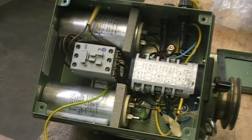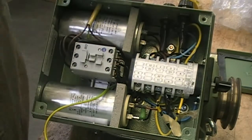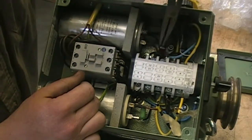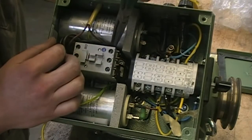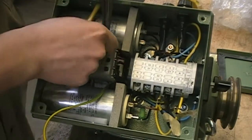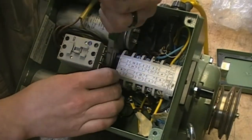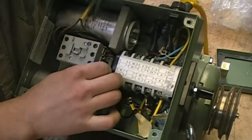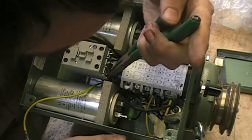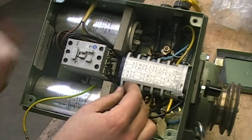Now one and two are a little bit more difficult. They're not actually connected directly to the switch — they're connected to the contactor over here. So if we disconnect number one wire from the switch and pull that back, we should be able to find where it's connected. This appears to be the number one wire here, which went to this terminal on the switch, and that tells us this is the number one motor wire because it went to that same terminal.